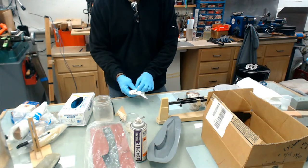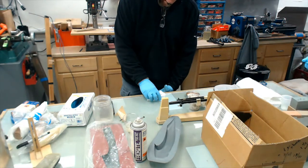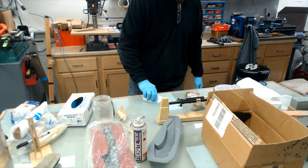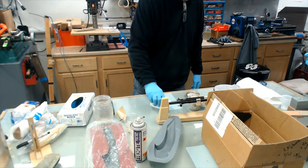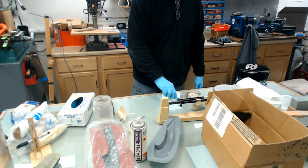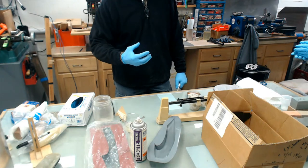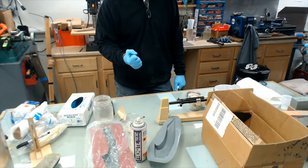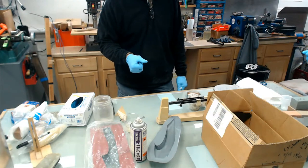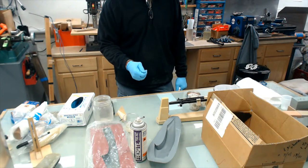Well, when I say stages, it's nothing real scientific in my mind. It's just when you take resin and it flows, like when I first mixed it in the cup, that's just the raw A stage. When it B stages, the resin is sort of rubbery, but it'll leave a fingerprint if you push hard on it.